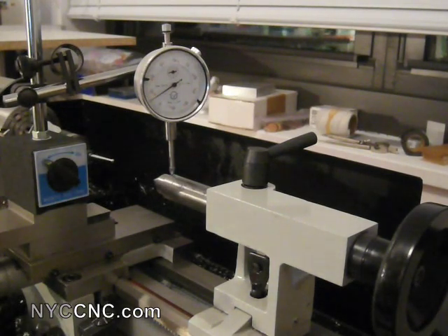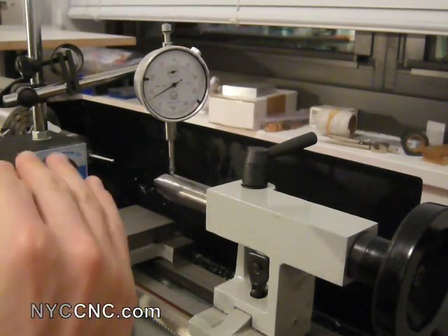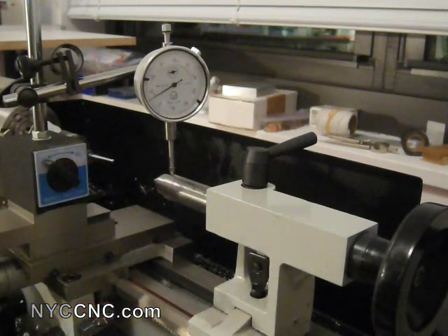That runout is directed high. As you can see, if I pull the needle up, it continues to move up — so the exaggerated view is that my tailstock is pointed towards the sky. I'm going to start working with my mini lathe and not worry about that amount of runout, but it's definitely something I'll try to take into account when doing accurate work, and if I need to shim it in the future, I'll look into it.